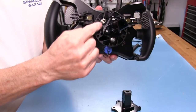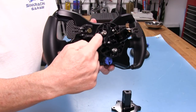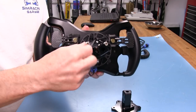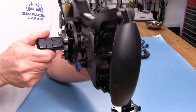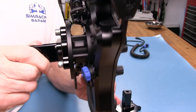Because when the bolt goes through this, and remember there's a thread in that flange, so I'm threading it through, the chances of it hitting this flange and engaging the threads in those holes properly so that it'll keep screwing in usually are not very good. But look at this, all three of them. And they came out about the right length too.